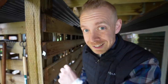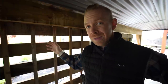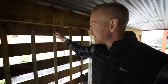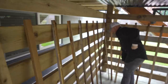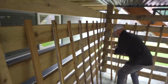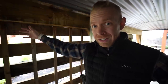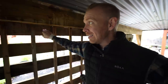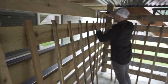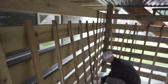The security isn't done yet. Coming to the inside, my dad made the really good comment when I showed him putting up all of the two-by-fours that people could theoretically just pry one of these boards off somewhat easily. So he recommended taking some leftover small little slats — just one-inch little members — and screwing those in vertically. Now what happens is somebody can take off a top board if they really want to, but this board is going to stay put because it's screwed into all these vertical members. I put those all the way around at roughly eight-and-a-half-inch intervals, and it just looks like lattice from the outside while serving a really nice security purpose.